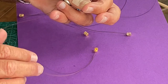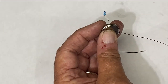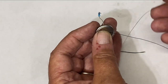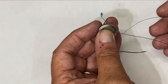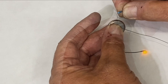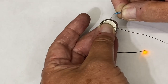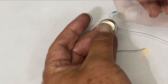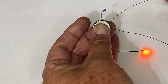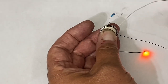I've glued a resistor to the positive side of this little battery disc as a safety precaution — I didn't want to burn out any of the bulbs since I wasn't familiar with them. The only thing the resistor does is give you less glow, so you don't have to worry about burning the bulb out. If you don't go through the resistor and just touch the battery directly, you get a much brighter light — so you don't really need to put the resistor on there.